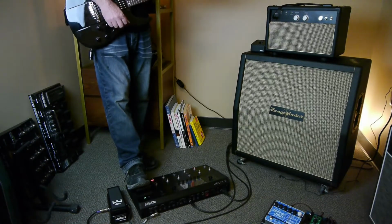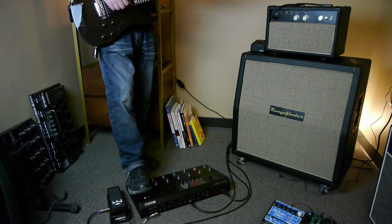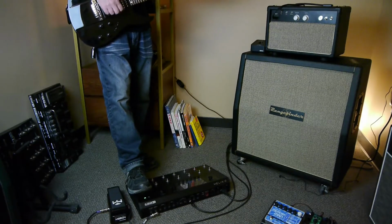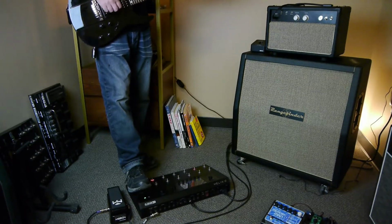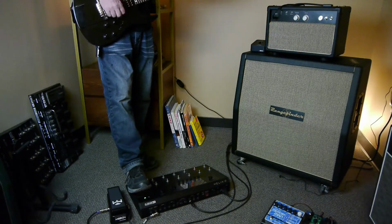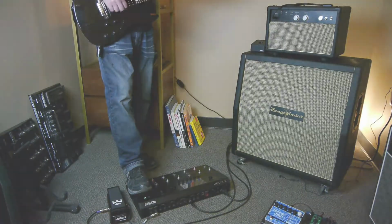Here I have an acoustic guitar going through a standard setup volume control pedal, and then through the VM Pro with sparkle. You can hear with the standard effect, it gets darker as the volume reduces, but with sparkle enabled, the high frequencies are preserved, even at lower volumes.